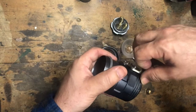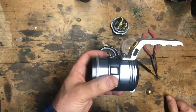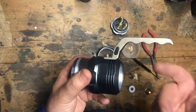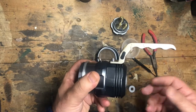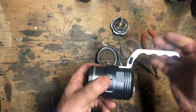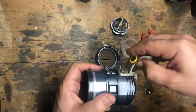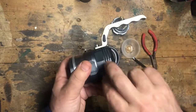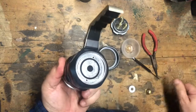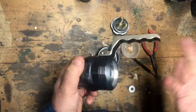Clive's version had a charging port, and this has the rubber cover for a charging port, but it's actually just empty because I got the version without charging. The same AliExpress listing also had these with charging capability, but I didn't bother because I prefer charging my 18650s using a proper charger outside of appliances where I can control balancing and make sure they're charged well. You could very easily adapt this by putting a cable in here — there's tons of room inside for a protection circuit — but I don't like doing that because you're not going to get any balancing. All of these cells are in parallel, so I'd rather charge the 18650s outside.